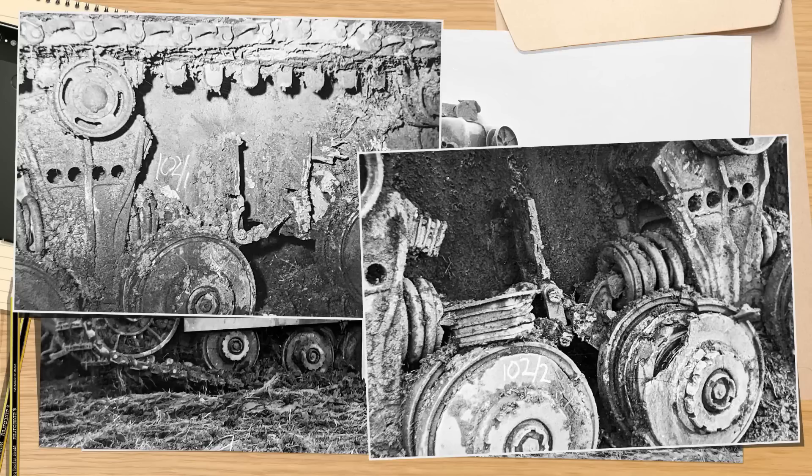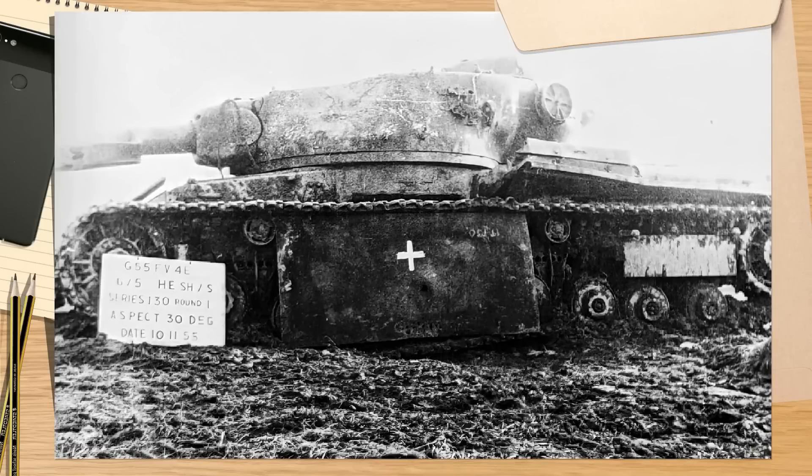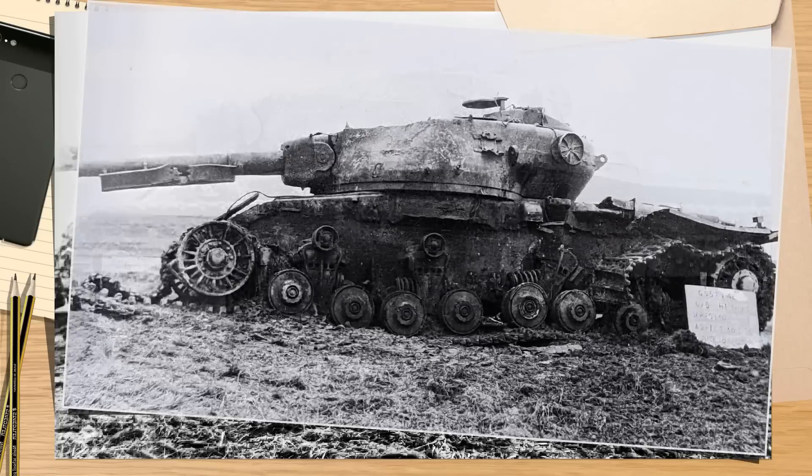These results surprised most involved that no significant damage had been done, and it was put down to possibly faulty rounds or fuze problems. To confound this a bit more, the regular AVRE rounds with 26 pounds of filler were fired next. These worked somewhat better — the tracks were severed and the road wheels were damaged, with large amounts of pitting and twisting to the lower hull and suspension points, while a large 17-inch crack was found in the hull. A full strip-down had at least two pages of minor damage listed, from loose wires, cracked parts and missing bolts, all of which would have taken a significant repair time. However, from a combat perspective it was a mobility kill, and only just.